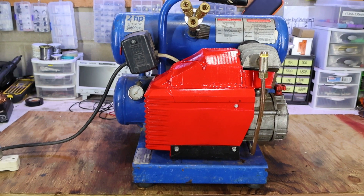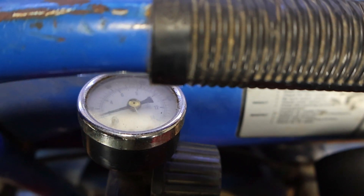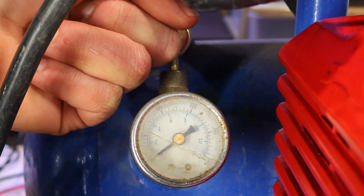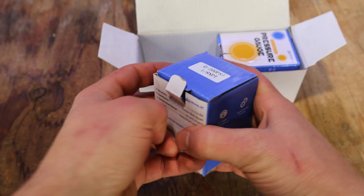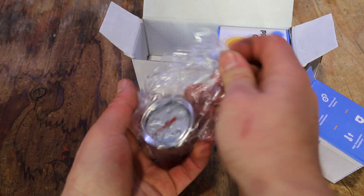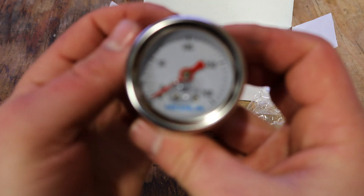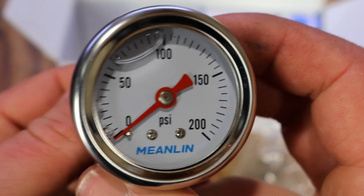Now on to the first upgrade. These pressure gauges are quite old, therefore they are not that accurate anymore — this gauge is showing 20 psi while the compressor is at 0 psi. Most compressors come with regular dry pressure gauges, but I went ahead and spent an extra two bucks to get the liquid-filled ones. These gauges not only last longer and keep the needle steady while the compressor is running, but they also never fog up from condensation, since there is virtually no air behind the glass.